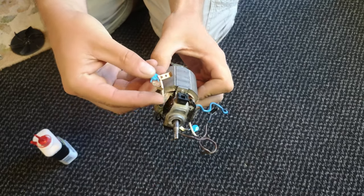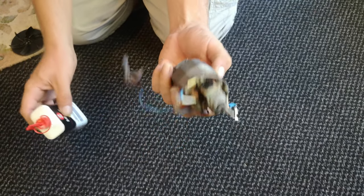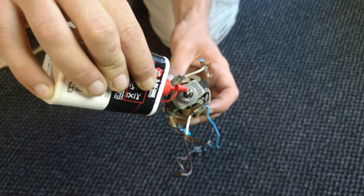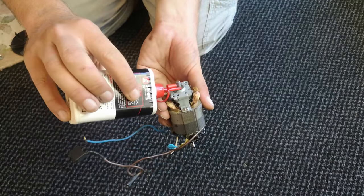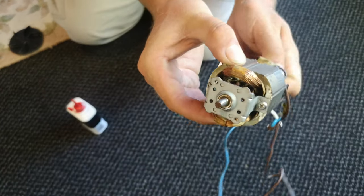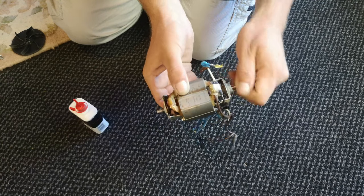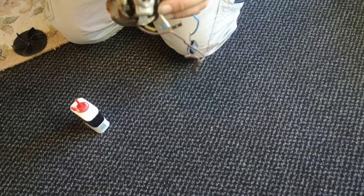The coil screws get popped back into place. Then with the coil flipped around the right way - because these need to correspond with the carbon brushes - we can take a little drop of oil and put some into the top bearing. Put a nice bit in there so it soaks into the little felt pad. Just a little drip in the bottom too - this is a sleeved bearing. I know some people don't like me doing this, but it's not going to hurt. Just tap the ends until you get it spinning as freely as you can.